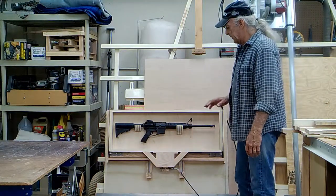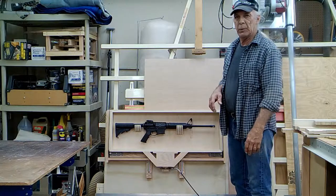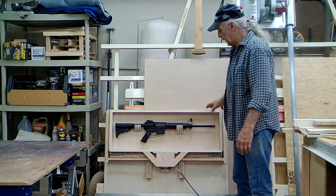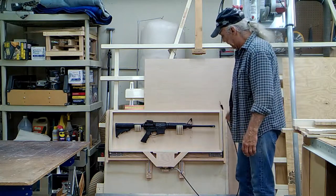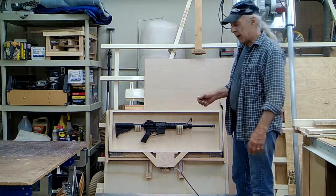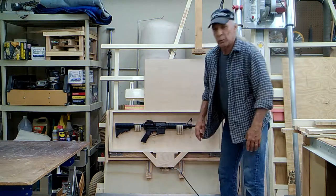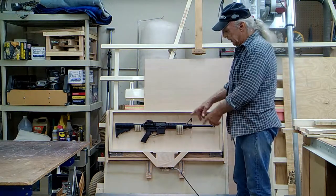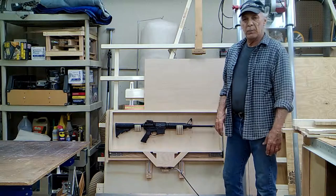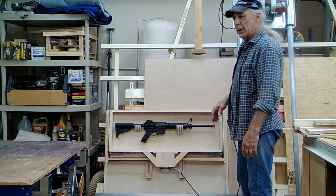This is my latest project — a cabinet, chest of drawers, or bureau — and on the back side of the bureau I want my weapon to rise out of the back of the top of that. This is the lifting unit I've created, my gun concealment tray. It's got a perimeter that ensures my three-quarter-inch backer board remains flat. I've got two 250N gas shocks that operate my lifting arms, and between the two arms is a helper spring which gives me a little more lift depending on how much weight I need to put in this tray.